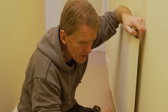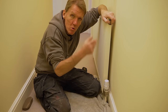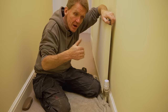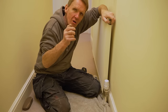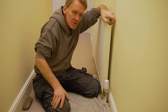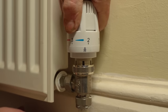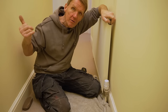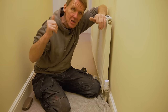What this valve does is it switches the radiator flow on and off. If you go down to say three and the room is warm — say around 15 Celsius — this valve will close and cut the water off until the temperature in the room falls, then it will begin to open and let a trickle of water through. Gradually, as the room needs to warm up more, if you've got it on a higher setting or the room's colder, it will open up so you'll get a full flow of water through the radiator. So it's not changing the temperature — it can't change the temperature. The temperature is controlled at the boiler. When it reduces the flow, sometimes you find that you get better heat out of another radiator, because in a way these radiator valves are self-balancing the system.